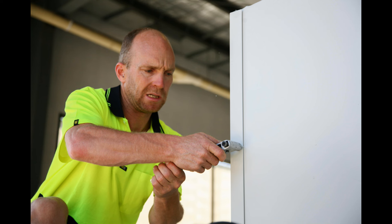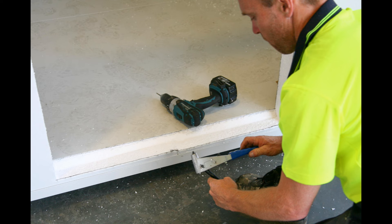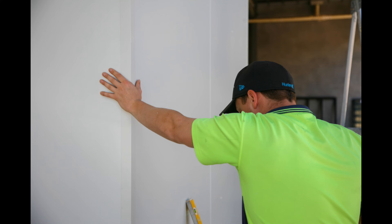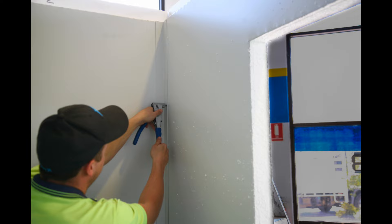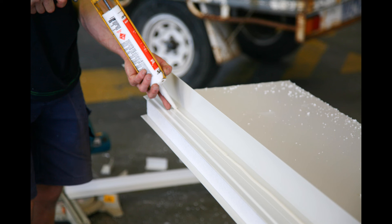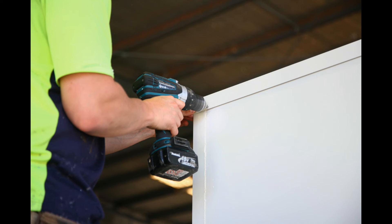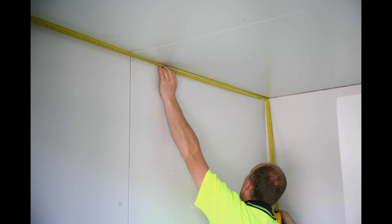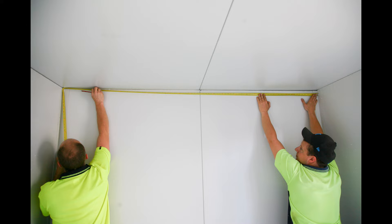Check the levels. Next, we need to fasten the upper and lower interconnecting front wall pieces. Next, we need to fit the front portion of the roof into place. Measure the roof length and cut. Seal and fit the exterior roofing angle. The wider edge fits to the roof and the shorter edge to the wall. Measure all internal lengths and cut horizontal internal angle lengths to 45 degree angle at the ends.